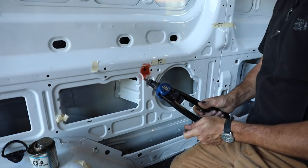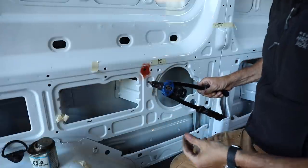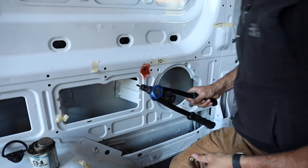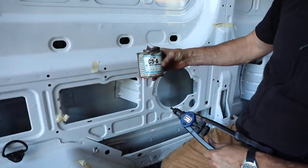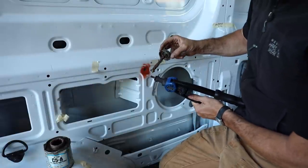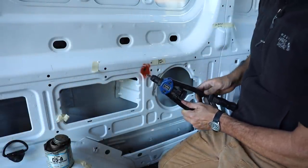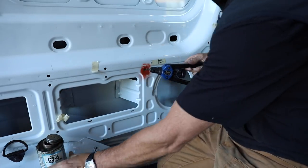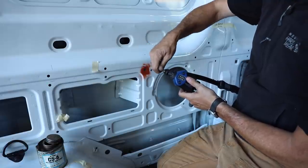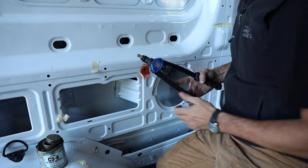Primer's dry — we are ready. This is the cool part. I love this tool — the Astro 1442. It comes with different sized mandrels; 5/16ths is the biggest this one will do. Because we'll have multiple people up on the bed, we want it strong, which is why I'm using bigger bolts. Do yourself a favor and have some anti-seize lubricant in your shop — this is high-temp with copper in it. When you're using stainless steel bolts they will gall, and once they gall you'll never get them out and you'll strip off the head. Use anti-seize on the tool's mandrel too — anytime you have a threaded tool used repeatedly, it makes things work much better and protects the threads.